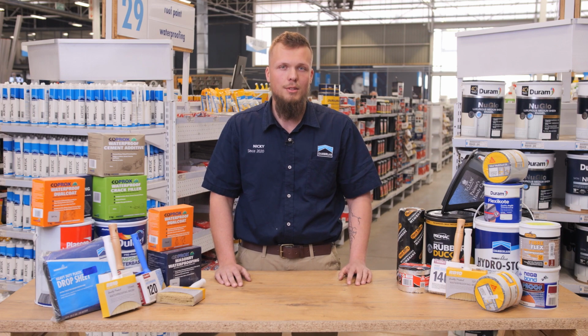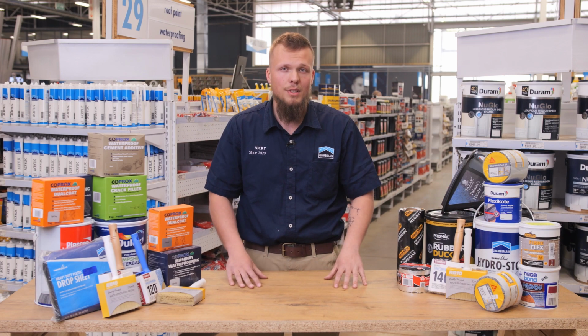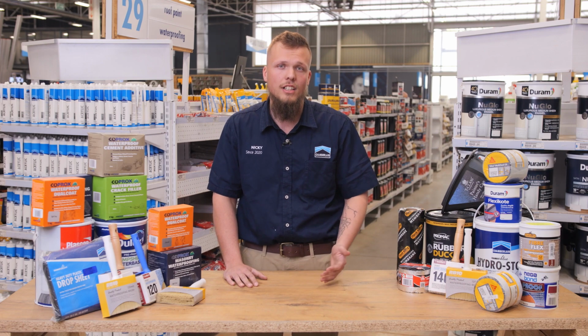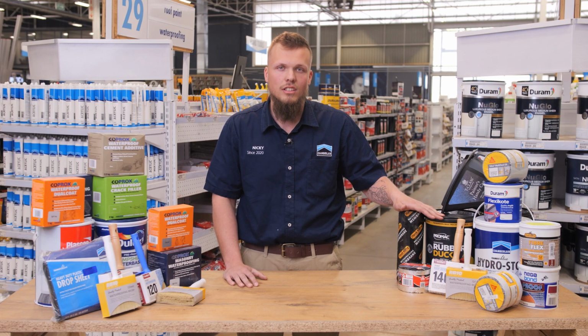Waterproofing is mainly used for your roofs. You get two different types of products. The one that has an extruded membrane, you need to soak the membrane inside of the product. That gives you a watertight seal. Then you get the new age, which you just paint directly over. The new age products have the membrane already included inside of the product.